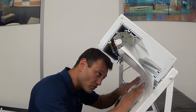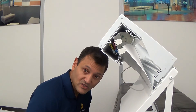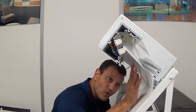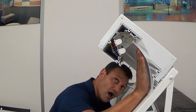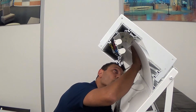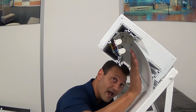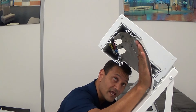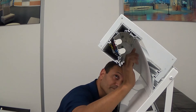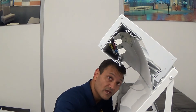Once you've allowed the bottom of the reflector to rest into the groove and the upper portion is just resting in the lamping area, slide to tighten up against whatever your end cap happens to be. Now, take your hand and just push very gently up on the top of the reflector material until it pushes just past the screw that's holding in the upper extrusion. Do this all the way down the run — just barely past. Now your material is kind of held temporarily in place. Go back to the end of the run and push again just a little bit until the top of the reflector material rests itself inside the groove of the upper extrusion. Use your fingernail to just ride that all the way down the run into that groove. Now you've got the material captured inside the groove.